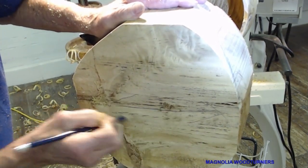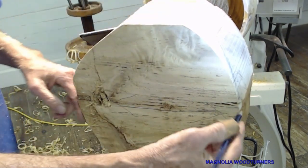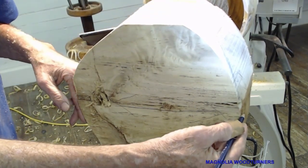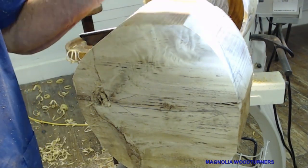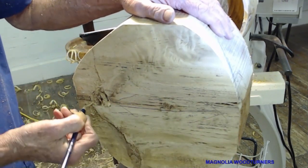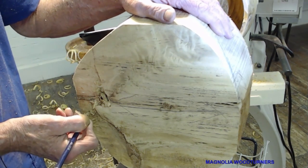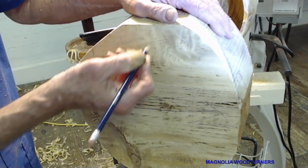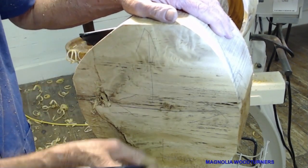We said that doesn't change very much. That length does not change very much. This is pretty consistent. So if I take a wet 2x4 and put it on a building, the length of it is going to stay the same, but it's going to shrink from the side. So that distance there, when it dries, will remain about the same whether it's wet or dried. That does not, because that's coming in from the side.